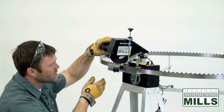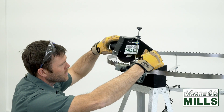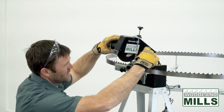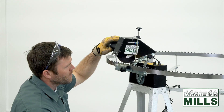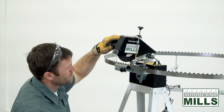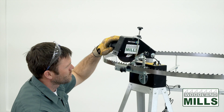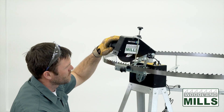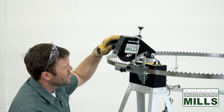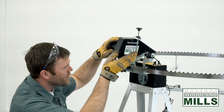The disc is coming down and I've got to start adjusting this to get closer to the face of the tooth. I'm pushing too far right now, so I'm going to back it off and come down — what we want to do is just take that four thousandths of an inch off the face of the tooth.